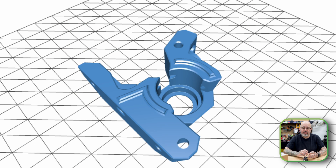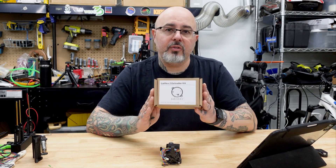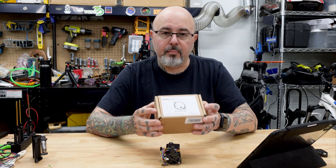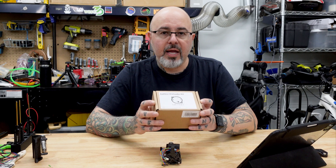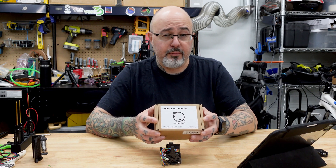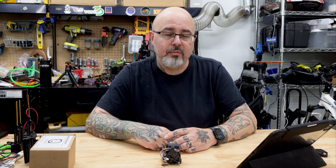If we look at the STL for the front of the extruder, you can see that the filament path is very well constrained. There are physical guides in between the drive gear and the bearing that it meshes against to make sure that the filament can't travel. So I picked up a Galileo 2 extruder kit, which gives you all of the gearing, the motor, your bearings — everything that you need — except for, I believe, three M3 screws of different lengths that are listed in the bill of materials on the GitHub page for the Wristwatch.